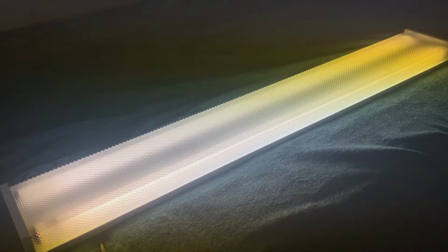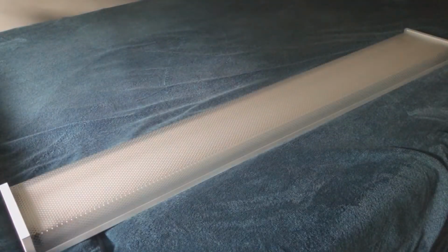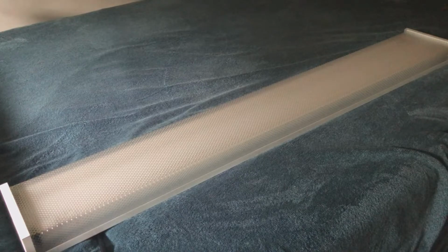And there was quite a bit of flicker as well with it. You can see our flicker band there from our fluorescent lamps. It looks like it's yellow with a little bit of green, so probably some kind of triphosphor halophosphate mix of some kind. Well, we'll turn it off and turn it on again. Nice. I wouldn't expect such a cheap ballast to give such a long, good, rapid start.